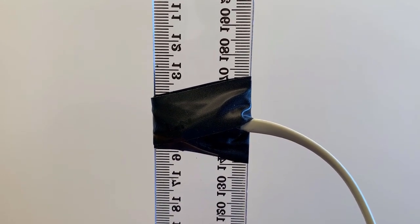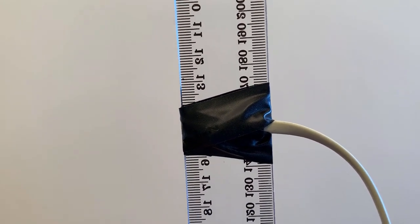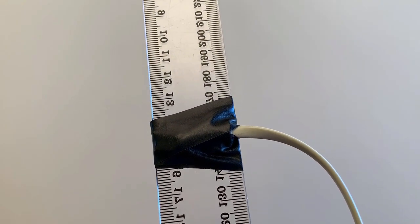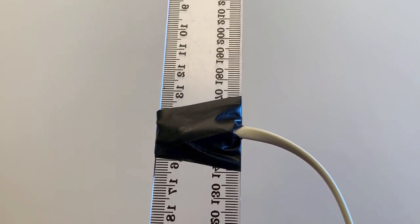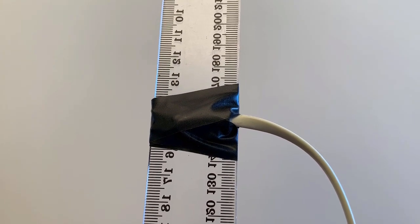Now I focus on the right side of the sensor. I point the right side of the sensor vertically and search around until SarkTrack stops beeping. This is point number nine complete. Next, I point the right side north at my local magnetic inclination and search around again until SarkTrack stops beeping. This is point number ten complete.